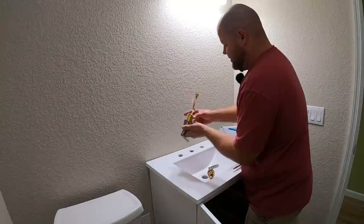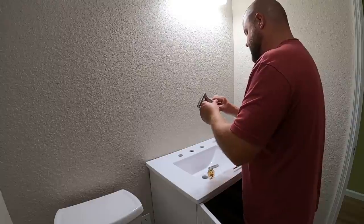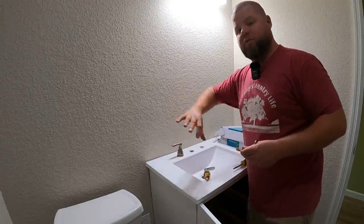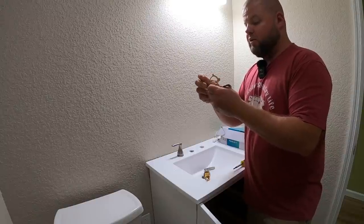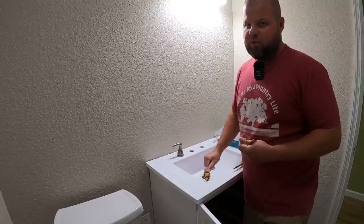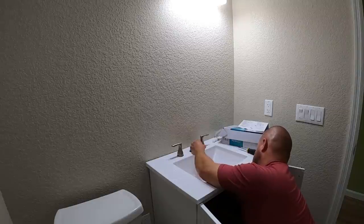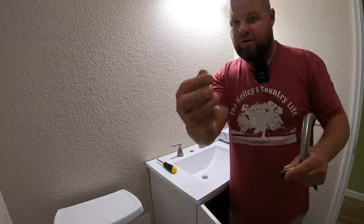The dishwasher is still running outside, so let's start putting faucets in. I've never done this three-position style — I've always used faucets that were all-in-one, but this shouldn't be overly complicated. The handles come with brass nuts you can hand-tighten and then screws you tighten with a screwdriver to keep the handles from slipping. I'm going to be careful because the tops of these break relatively easy — the first one we picked up was broken all the way across and we had to return it.